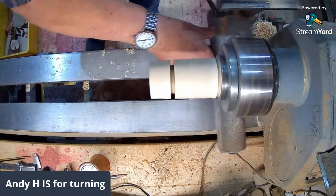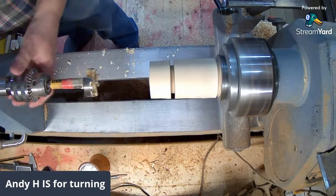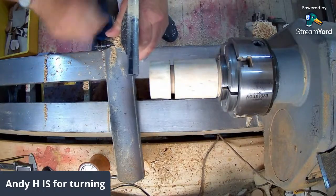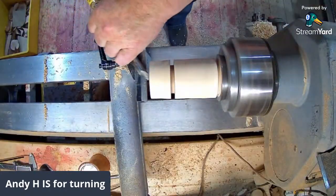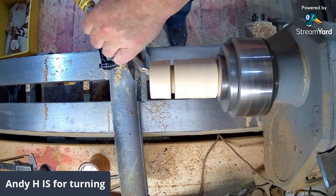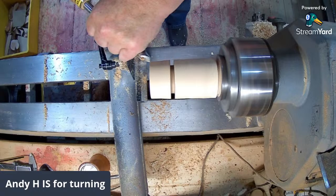Right, okay. This time we're going to drill the right size. Right, depth. It really depends, Douglas, what you call thin. Ashley Isles do a steel, which you need to put into a handle, that is 1.5 to 2 mil wide as a parting tool, which is the one I use. I find that works quite well because you can put it into a longer handle. Make yourself a longer handle to put it into. I think the one I was just using was sold as a 2 mil. Right. And Mark's saying that Simon Hope does one as well.